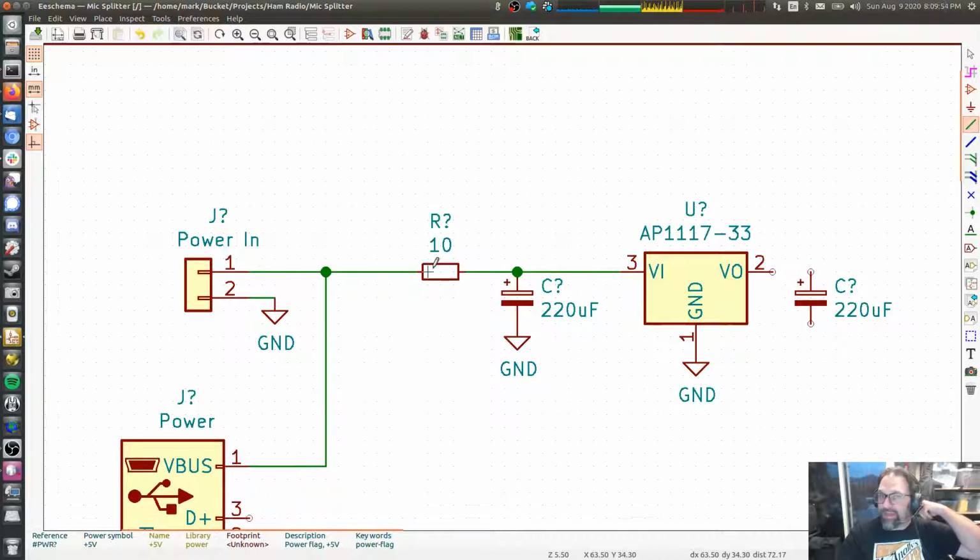The idea being that it is a place for voltage to drop, so that coming in, you can have all kinds of noisy voltage coming into the thing, but it has a very fixed voltage reference internally, and it's forcing everything on the output to be at that fixed voltage. So you can have all kinds of noise on the input. The output voltage isn't determined based on the input voltage. The output voltage is determined based on the voltage reference inside the chip. And that doesn't change regardless of what voltage is coming in on the input.